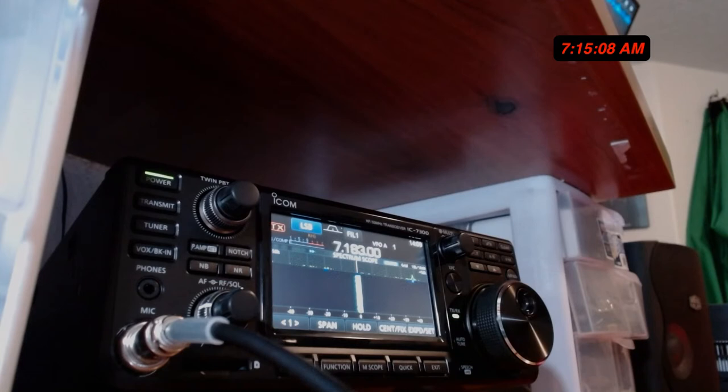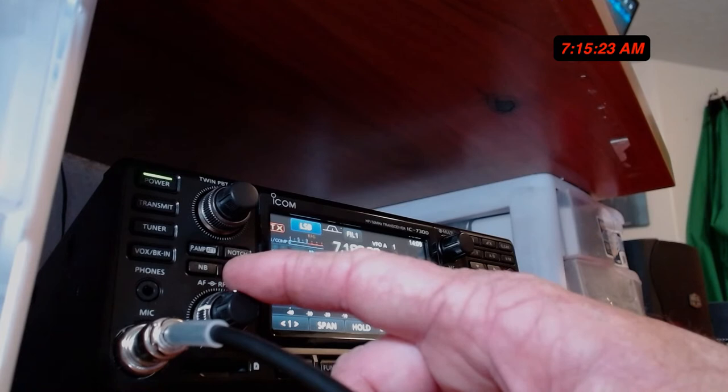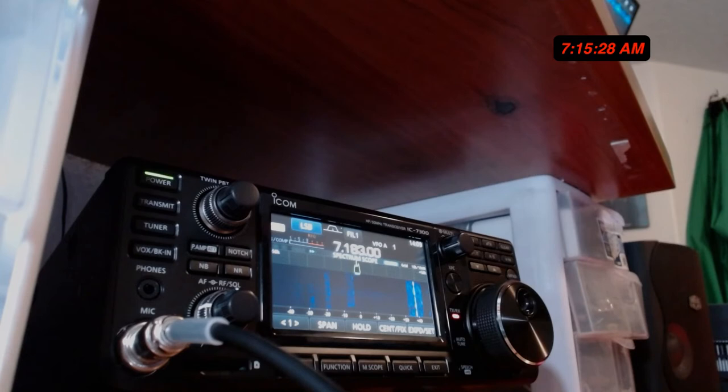And we're right about the time where we can make the switch. In Boulder right now, the MUF has gone up to 15.54. Right about the maximum usable frequency is where you're going to make some DX calls. We are going to QSY to 20 at this point. Kilo 7 Hotel November, QSY to 20 meters.